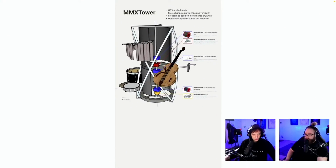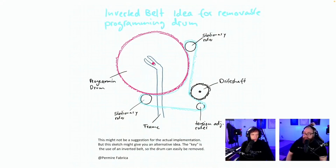So in my gear trains, I want to apply the force on the outside of the ring. So basically, I'm going to try with something smaller. Yeah, I think you get what I mean. So this is a little bit why I want to have these big gears, putting the belts on the outside of the wheels, because of the torque. So we don't only have to think about gear ratios, we also have to think about where we apply the torque and how. Was that super clear, Martin?